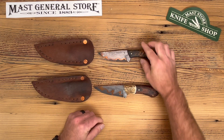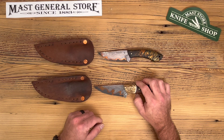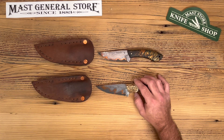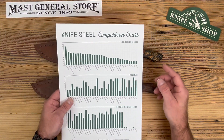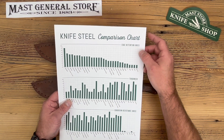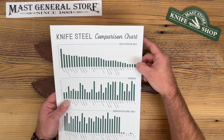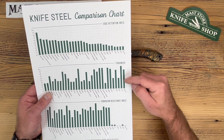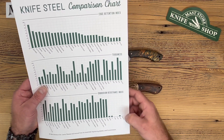If you know anything about steels, he uses 80CrV2 as a base layer because it is an extremely tough steel. You may know Winkler knives — that's the same exact steel they use on their military blades. On edge retention it ranks pretty average, but that means it's easy to sharpen and you can get a quick edge on it. On toughness, it is extremely tough — it's hard to break or chip this steel — and it is not stainless, so you need to take care of it.